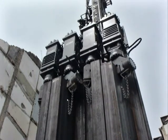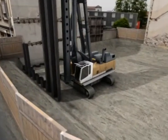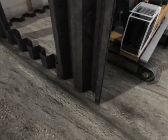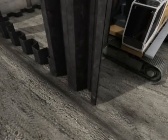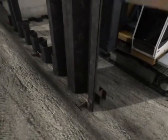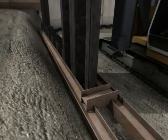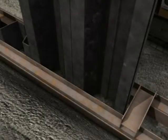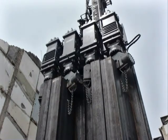Interlock friction should be reduced during the pressing process. For pressing the sheet piles into the ground, they have to be guided in the lower section in order to guarantee their correct alignment. The guiding tongs should consist of strong double T beams and be arranged on the ground. The free flange end of the sheet pile panel is guided by a guide block during pressing. This prevents the sheet pile from turning within the guiding tongs. Greasing of the interlock also helps to reduce interlock friction.